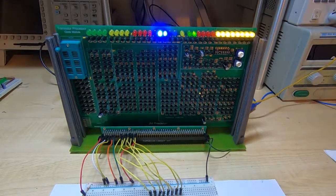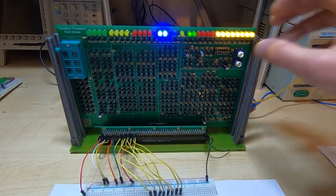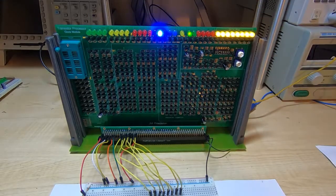The first check is to make sure that all the lights are as they should be, which they are. Then we move on to testing the ring counter. We just need to make sure that when we press clear, just the first LED is on, and then it counts sequencing from right to left — which in this case is working fine.